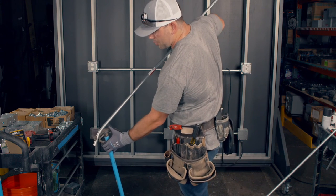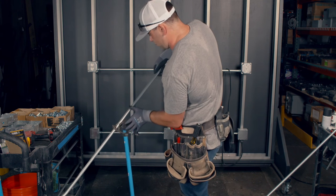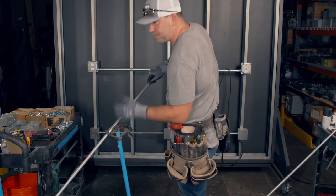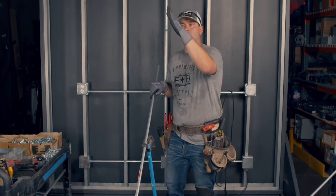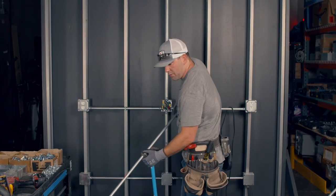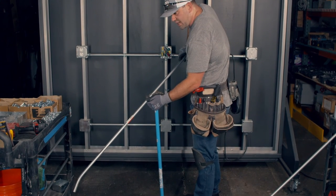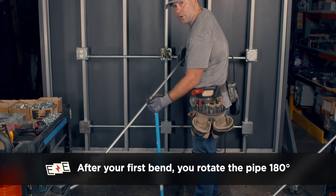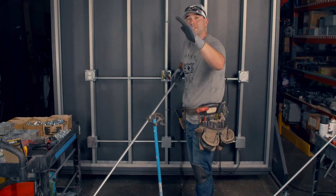All you do is push on the conduit until the bottom of the conduit comes parallel with that 30-degree mark. Sometimes people push a little bit too much — with half-inch conduit, don't worry about it so much. Then you pop it up and push it in to where your next line is going to be. Find that next line and push it all the way in there. You line it up with that line. Now look at this piece of pipe — an offset goes up and then it curves down. My first bend was like this, then you rotate the pipe 180 degrees.